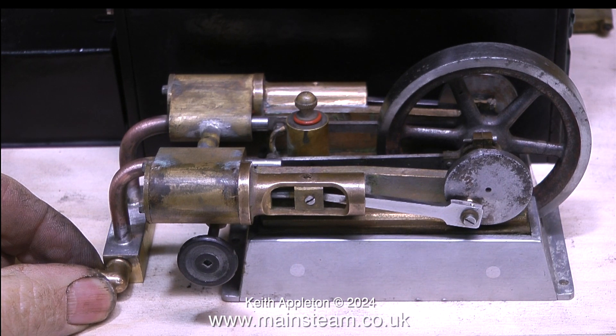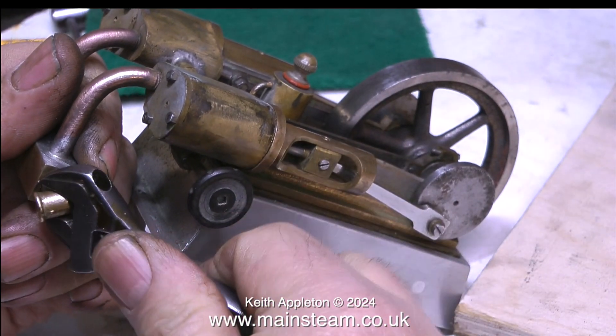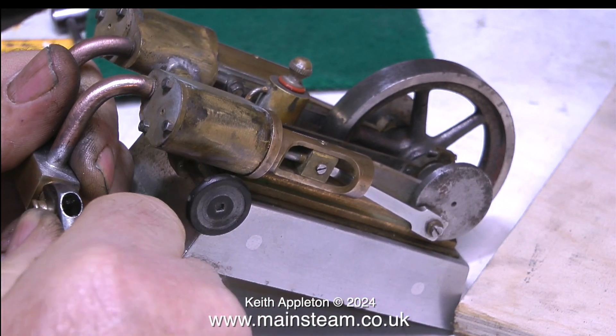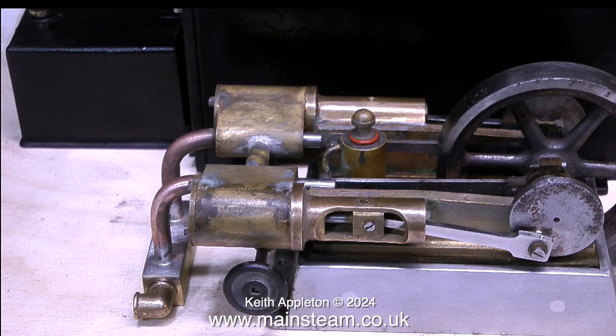I used another PM Research elbow screwed into the end of the exhaust collector, fitting it with a simple piece of threaded tube at quarter by 40. I like the effect — it's a square exhaust collector which matches the modified square base of the engine. I also have the option of rotating the exhaust elbow upwards or downwards should I need to pipe the exhaust through the baseboard.